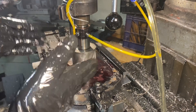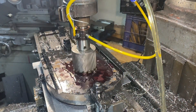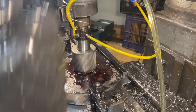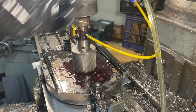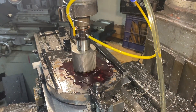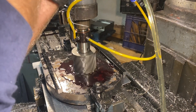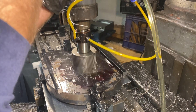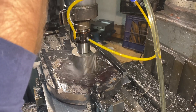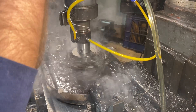I've got oil on the inside of the cutter and the outside. I looked up the speeds and I'm running at about 105 RPMs. I was power feeding at 3 thousandths per revolution, but I felt more comfortable just doing it by hand. Here we go — just pulling. This thing cuts fast, it just eats like butter. It's crazy.